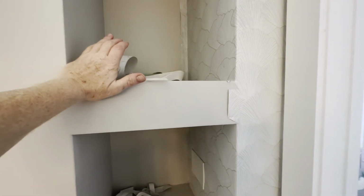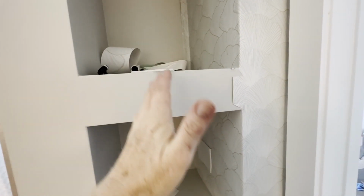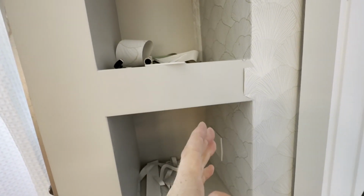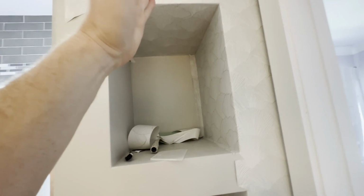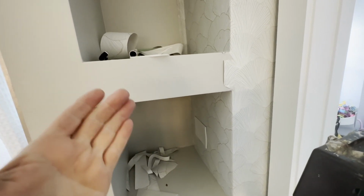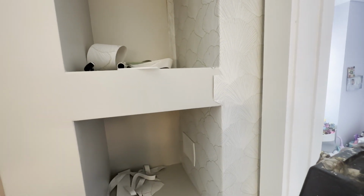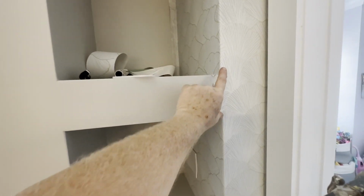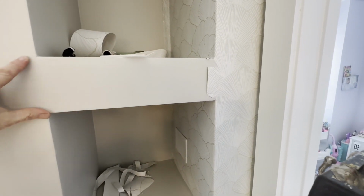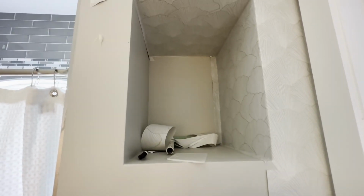I'll bet a lot of people said you can do it, but you can't, because here's what's going on. We have two competing runs. The wallpaper that goes on the facade isn't running at the same speed at which the wall covering on the side is running. And so what meets here is not going to meet here. You see how that works?